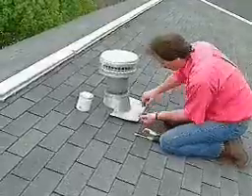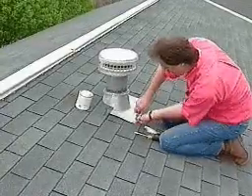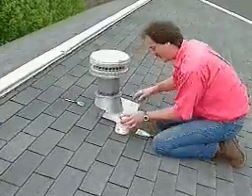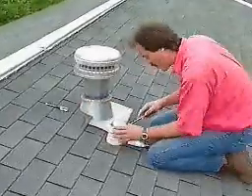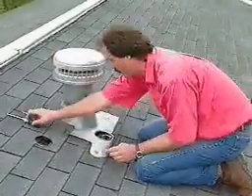To repair this, we're going to replace that half-inch screw with a one-inch screw just to hold down the flashing. Then we're going to come back with a roof cement and patch all the way around it. There are several different types of roof cements on the market. I prefer an asphalt patch. The reason is it'll dry quickly, nice and firm, but it's also holding its elasticity to give and take with the shrinking and the swelling of the shingles as the weather changes.